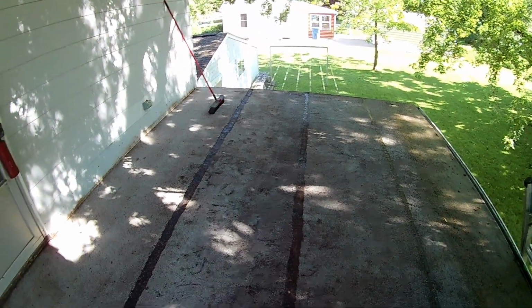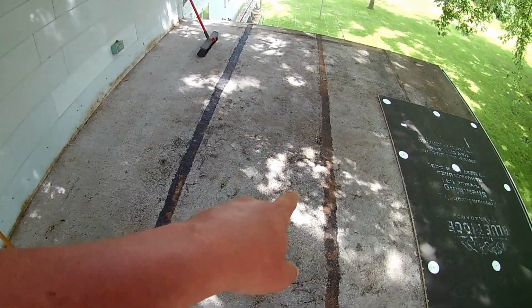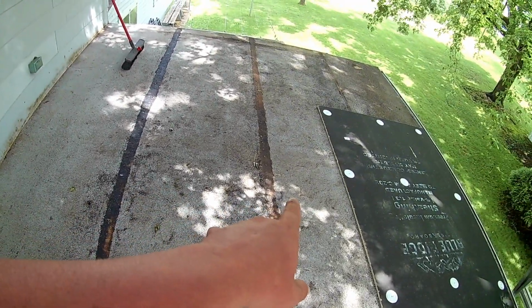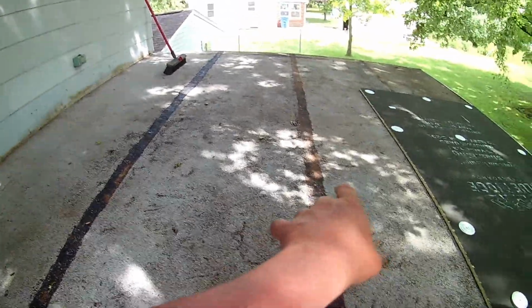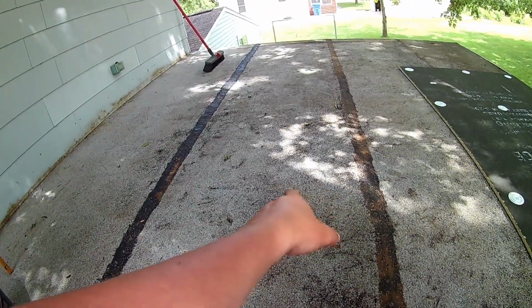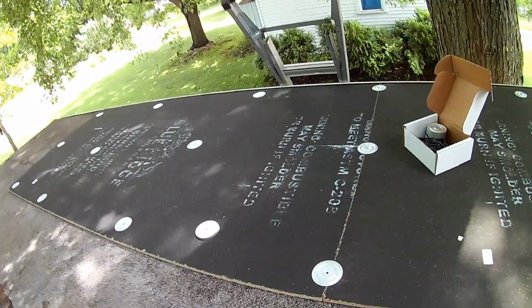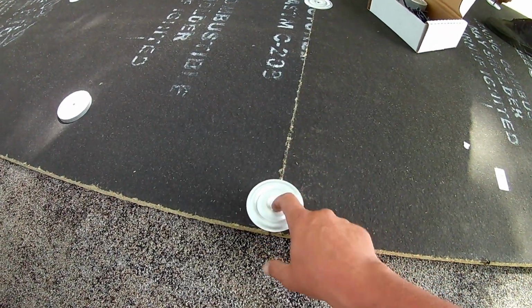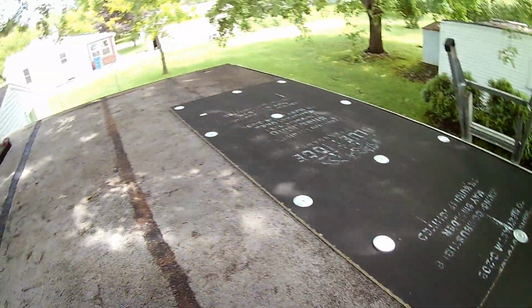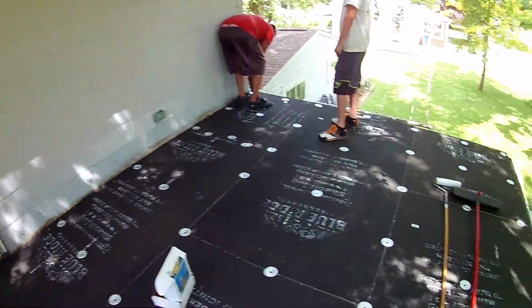Oh, we've got to go to the dump. And Menards. This is how we do these roofs. These flat ones, most of the time, we just go right over the top of them. We don't have to take them off. They're real thin and light, so it's not like you have to worry about weight, but you really have to worry about your decking underneath, and in this case, the decking's fine. So then we do a 1/2-inch fiberboard, and we do these insulation plates with like a 3-inch screw. That holds that down, and you get this guy sheeted. Well, there you have that part.